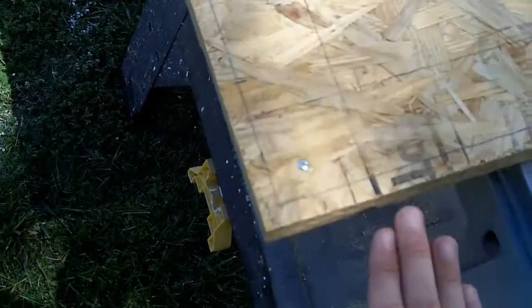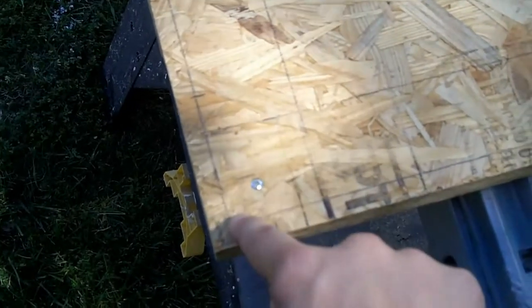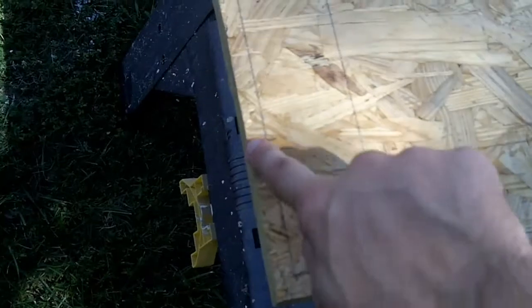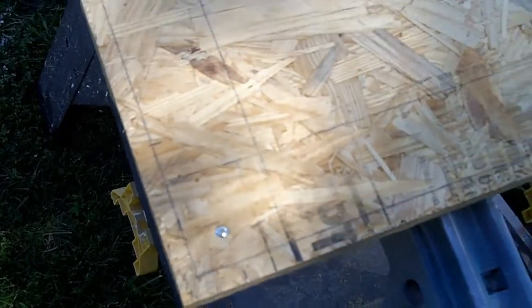It's going to roll over the sides, and it's even going to roll under the bottom of the table to this 1/2 inch mark. So I'm going to lay some tape here so that we have a crisp line where the concrete will end. Also, I'm going to have to smooth the corners and round them off with a sander, and we'll do that here in a little bit.